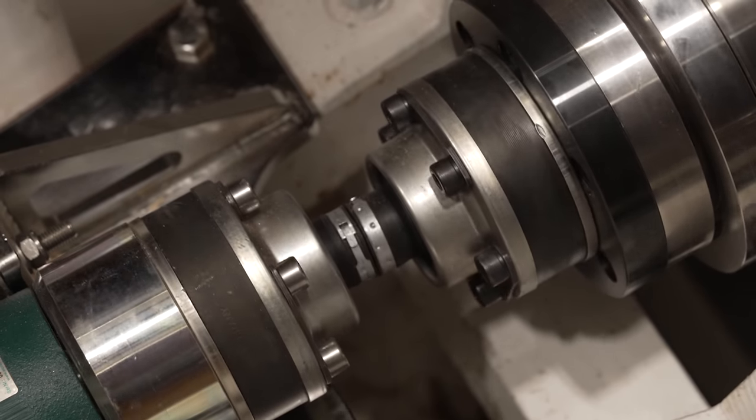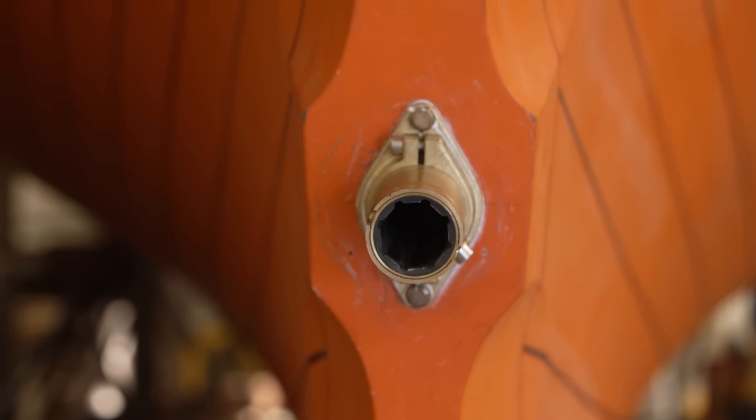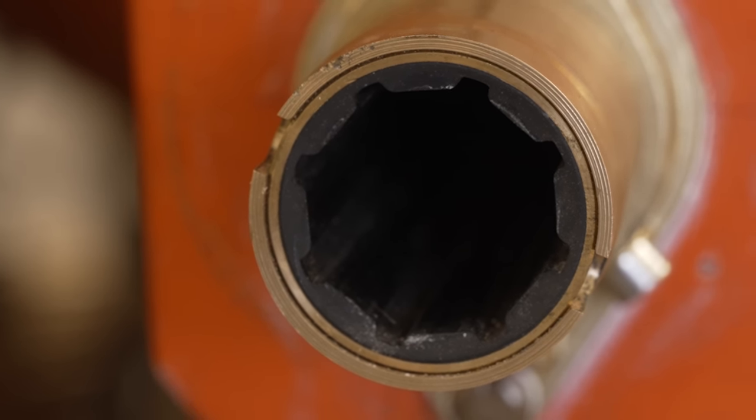Now we also installed the stuffing box, which is at the forward end of the stern tube. So the stern tube is just that, a tube which goes through the stern post. Prop shaft goes through that tube. On the aft end of the stern tube, there is a cutlass bearing which supports the prop shaft, and it has a lot of slots in it which allows water to go through and to fill up the stern tube. So the stern tube is actually full of seawater, as well as the prop shaft being in there.